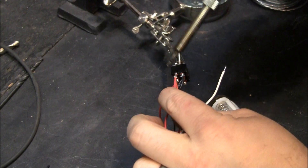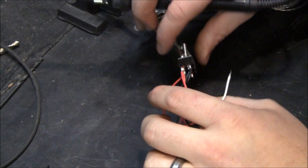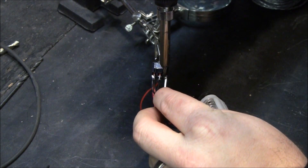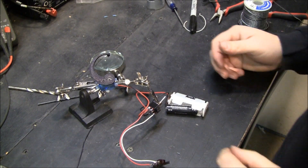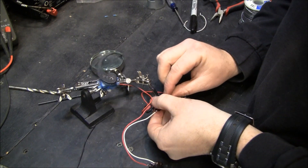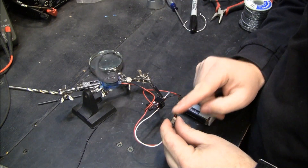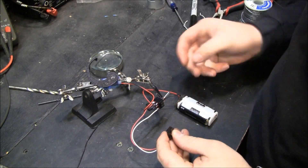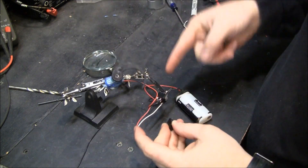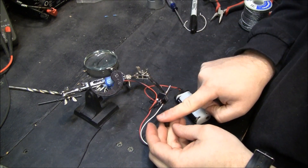We'll connect one of the wires here and the other one here. Here's the behavior you're going to see: when you switch it, it reverses the direction of the motor, but when it's going in reverse and you click this, it stops it. You can see that if you turn it on, it's going to come out, click the switch back, and then it'll hit this micro switch and stop.